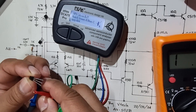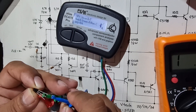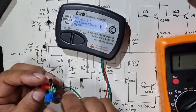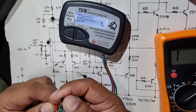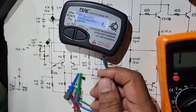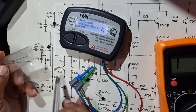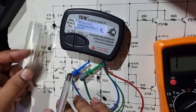This is a 2N5551 NPN BJT transistor. Testing it on the Peak Atlas — wow, it's 104 HFE, the same spec. I'll definitely use this one. I'll install these now on the board. I also need to replace the zener diode, and I purchased a 4.7k resistor just in case the existing one is also faulty. I'll be back shortly.